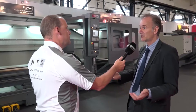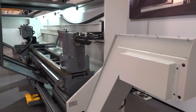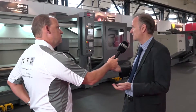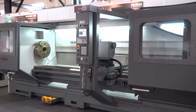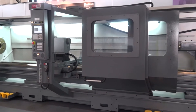So it lends itself to many various different industries — oil and gas in particular, although that market has been slower in recent years, as we all know. But it's a general engineering workshop machine. And one thing you have mentioned earlier today is about the turret here and milling. That's possible, isn't it? It is indeed. The machine is actually developed to take driven tooling as well as Y-axis, so you can have C-axis, Y-axis capability on the machine as well. This particular one is only a two-axis machine at the present time, though.